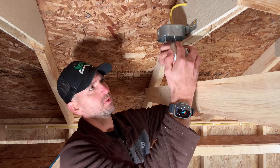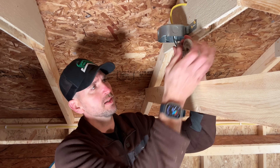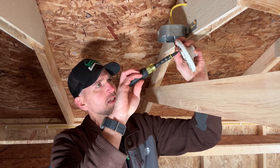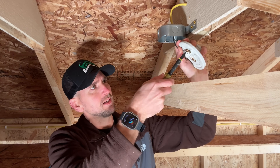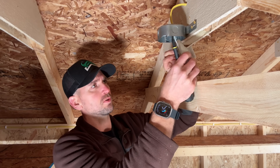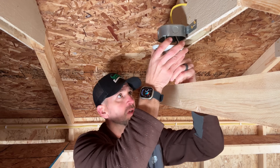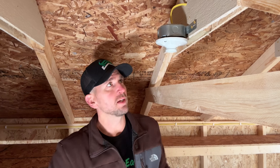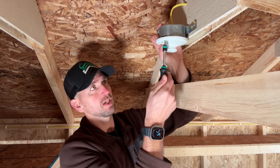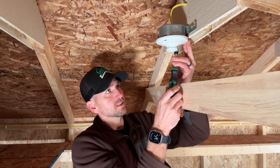It doesn't get much easier than wiring up a simple light. I'll take that J-hook around the gold terminal, making sure it's in the clockwise direction so when we tighten that screw terminal it will pull down. I'm using a Klein Tools multi-bit here — what I like about this one is it has two sizes of Robertson square bits, which help so much when tightening these screws compared to a Phillips, which is prone to cam out and strip those screws. Then we'll go ahead and connect up our neutral. Line things up with the two mounting screws, rotate into place, and with porcelain you want to tighten things up but do not over-tighten — you'll snap the housing.